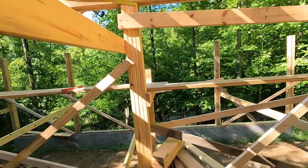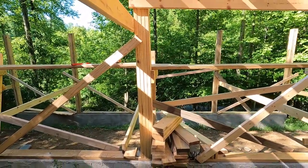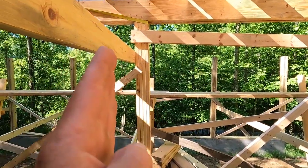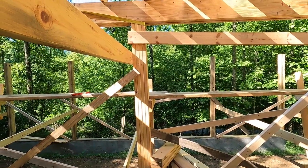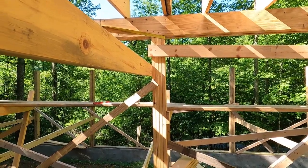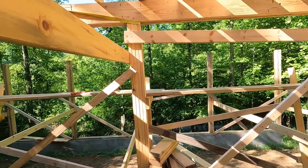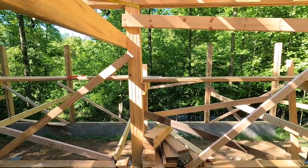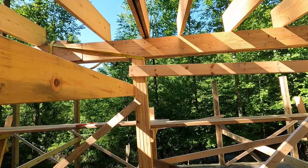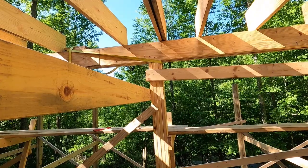My column is not straight and I don't care that it's straight at the moment, but I also want to make sure that if it's bent over and I move my beam, then I have to straighten the column and I didn't move it enough — now I have a different problem. So I'm trying to adjust this so it's a little more straight. I thought I had plenty of bracing on it, but this beam I calculated weighs like 750 pounds — not ginormous, but pretty hefty.